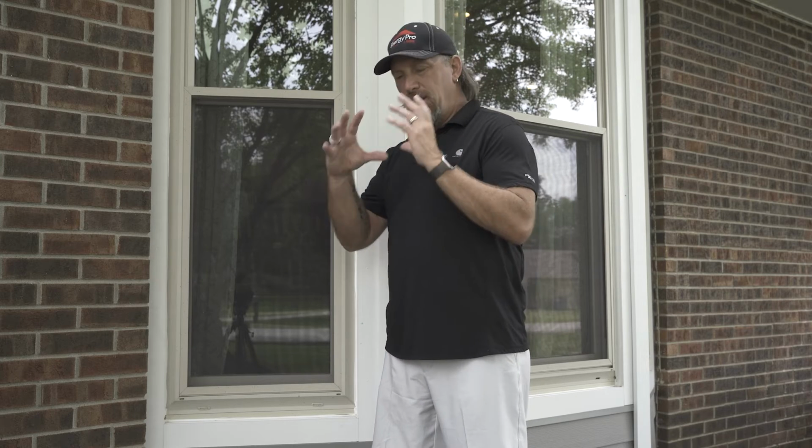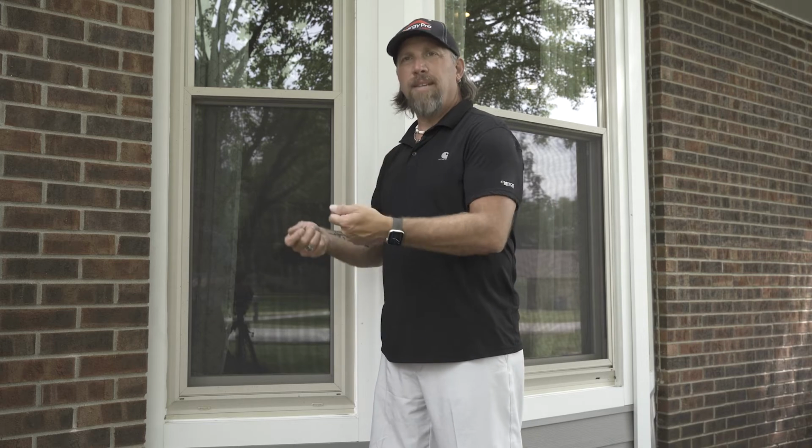At that point, in a wood pocket replacement, we're going to push that window into the interior trim where it stops perfectly, and then we're going to replace the exterior stops, and then we're going to add trim to the outside of the window. Again, casement windows, all kinds of windows. Each brand and each particular kind of window has a certain piece or part that was manufactured to be able to come out and be replaced.